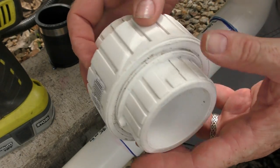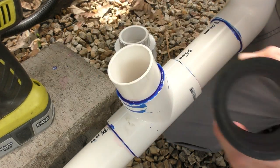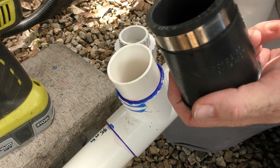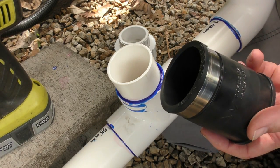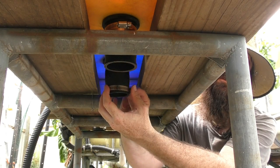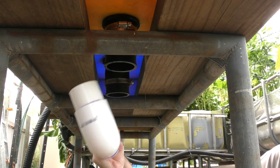What I came up with was using a pipe cuff zapped over the drain pipe and screwed in place. It gives me flexibility because the pipes coming through the bed may be on slightly odd angles due to the uniseals, and the bases of the barrels aren't perfectly flat. I originally wanted 2.5-inch food-grade vinyl pipe but it's very hard to come by — I've got some on order and will replace these drain cuffs with the food-grade stuff when it arrives. For now I'll slacken off the hose clamps and push them up the cuffs, then manhandle the drain pipes in.